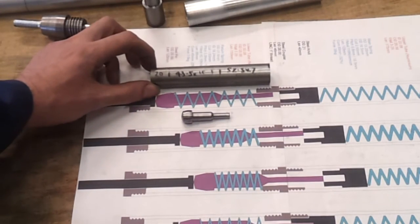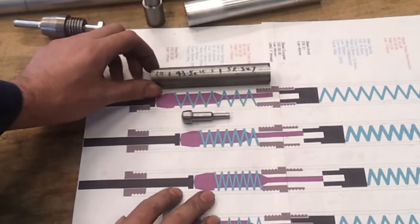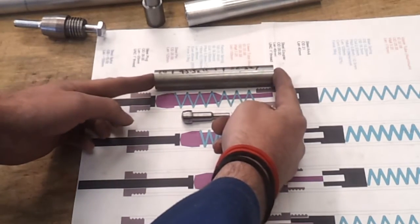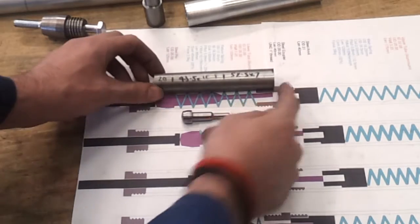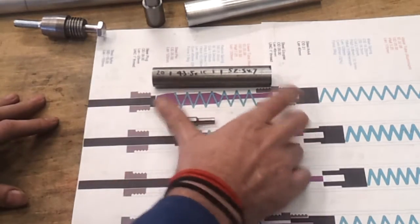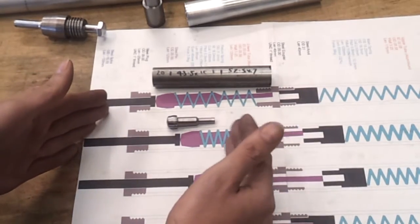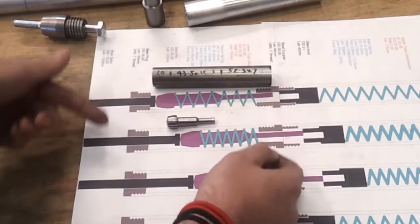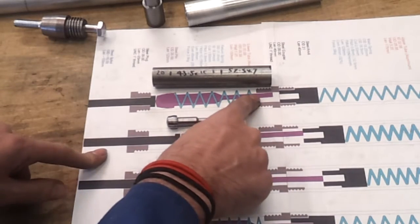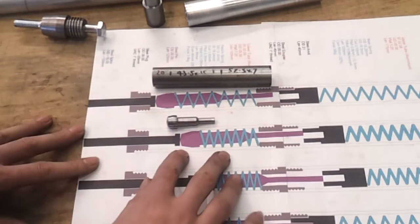The firing pin is probably one of the most tricky parts to be honest. The coupler needs a little bit of attention as well. This is already cut down to size - I've faced the ends off and marked out where it needs to be cut as per my diagram. I did spend a bit of time working on the angles to get maximum travel, but at the same time it's got to tilt a certain degree and this pin can't be too narrow otherwise it gets too weak. Quite a few devils in the detail there.